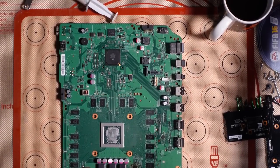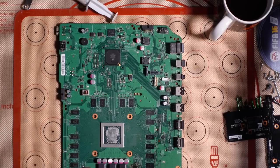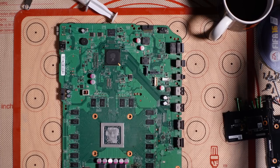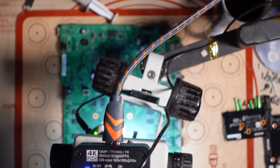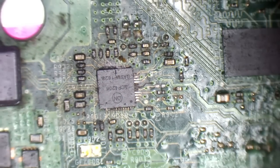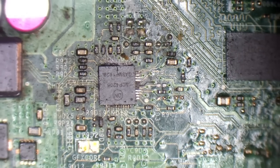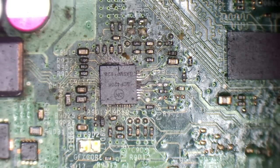Right, you want me to go under the microscope, yeah? Visual inspection. Do your 12 volt on and just check your standby voltages. Check you've got 12 volt as well. Well, I can already see a pretty rough problem. So can I. NC plug, yeah, that looks a bit cracked. It's not going to work like that. Turn the board a bit to the right and it'll look straight. There you go. Perfect.